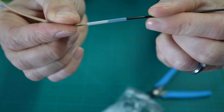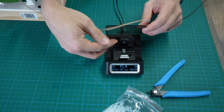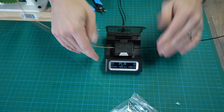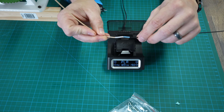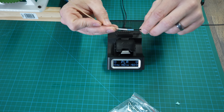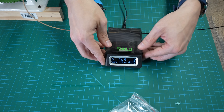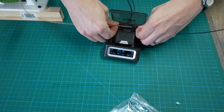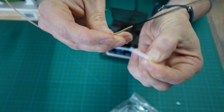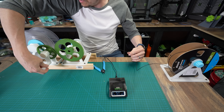Make sure the joint is right there in the middle of the sleeve. Then we open the device up, hit this little button to pop open the heating element area, and set those joints right over that heated area, then shut it. We'll wait until the beep, open it up, and apply just a little bit of pressure to make sure it's fusing together. Once this is cooled off, it will be fully fused. The last step is you push your filament down into this little groove, which cuts the tube. Push it down, open it back up, pop it out, and that creates a little cut so you can peel the tube right off your filament.